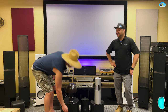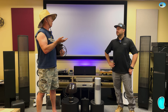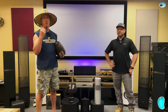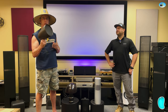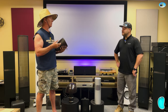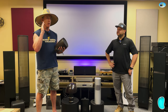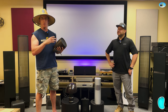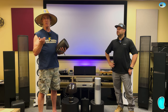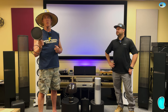There's also a thing to consider: when you're running wire all over the place in a large setting like that, there's some math involved, because with standard speaker systems, you can only run the wire a certain distance. This is what's called a 70 volt setup, and we'll put a link to it in our description. Standard speakers typically are 8-ohm resistance, and they utilize different electronics, a different setup. You have a finite amount of feet that you can run the wire before you get signal loss using 8-ohm. Typically it's anywhere between 130 to about 270 feet, and that varies depending on the thickness of the wire and the loss that you get. These type, you can literally run thousands of feet with minimal loss.